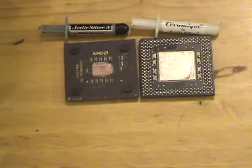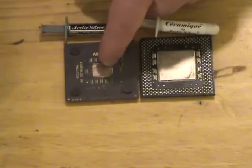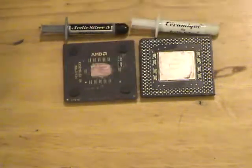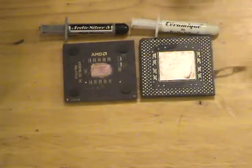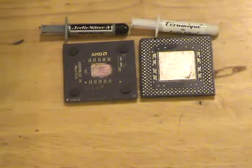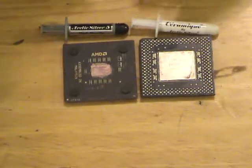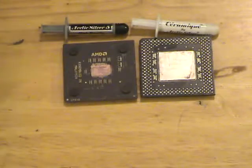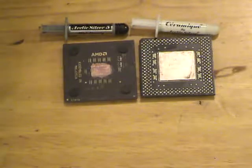The differences are, underneath here, there's a thermal paste in between this heatsink and the actual chip, like there is here. That will not necessarily be the best thermal paste in there, but if you go to try to pry that off, you're going to break your chip in half. Even if you do it right, there's a 90% chance you're probably going to break something, making your chip that you just bought utterly worthless and not really good for anything other than a paperweight or a keychain.